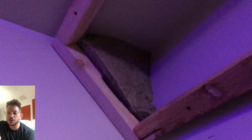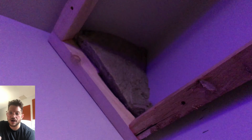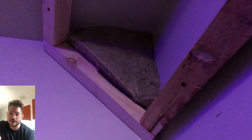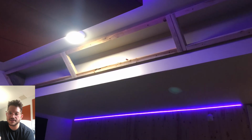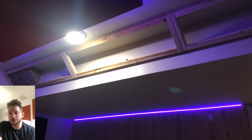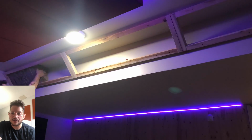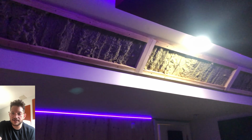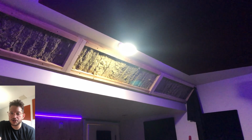And this upper portion bulkhead bass trap, you can see we're just doing the same process. Just insulating, we're cutting that Rockwool Safe and Sound on a nice triangle just to fit on the inside of the frame. And it'll be the exact same situation where we cut the Rockwool rigid Comfort Board 80 to sit within the 2x2 frame. There you can see it's all insulated in the Safe and Sound. And then we're gonna add the rigid insulation.